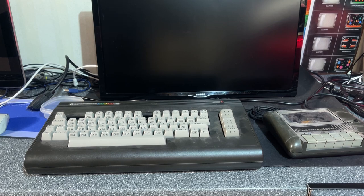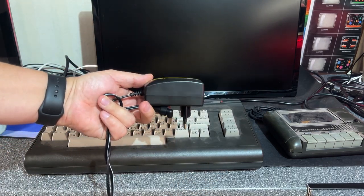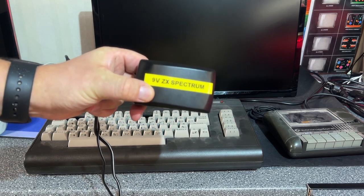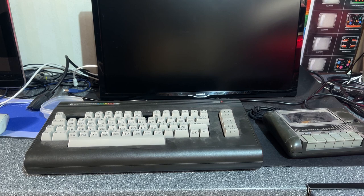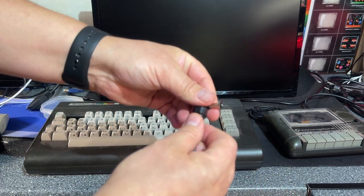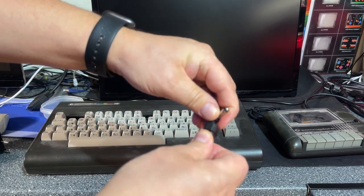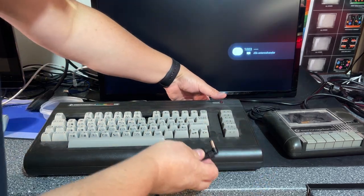Before I start I'm going to do a brief test. I didn't get the original power supply with the machine, but I have this generic 9-volt power supply here. It's marked as 9V ZX Spectrum but this machine takes 9V DC input, so this will work. We just need to find the correct polarity — this plug lets you change it. I think it's center negative.